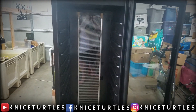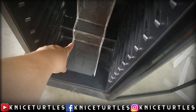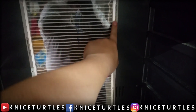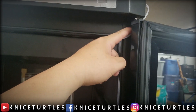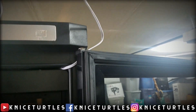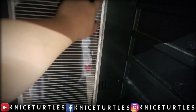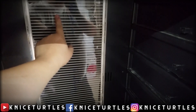Here's what it looks like installed, with the wires hidden behind the false wall and false ceiling. The way heat tape works is that as long as there's current, it constantly heats up — so you can't plug it straight into the wall or it will cook everything. You need to hook it up to a thermostat plug, which has a probe you place in the chamber. Once you set a temperature, it turns off when that temperature is reached and turns back on about three degrees below it, cycling to maintain the correct temperature.